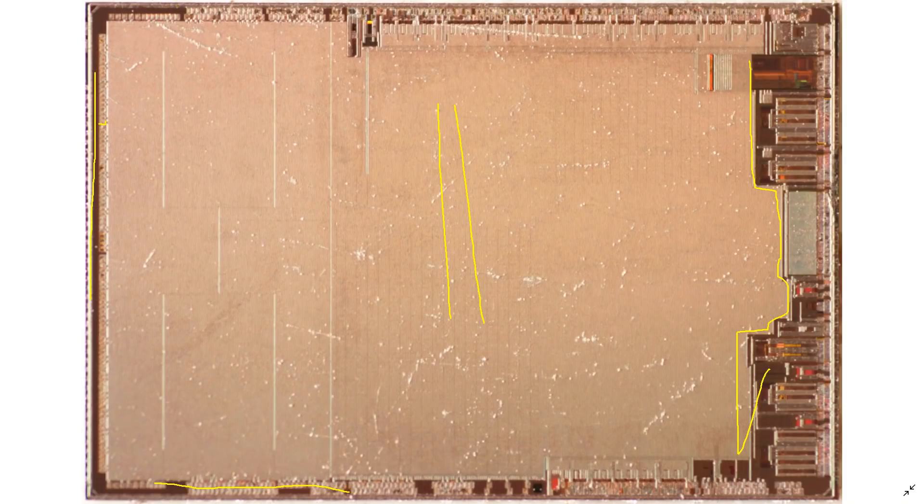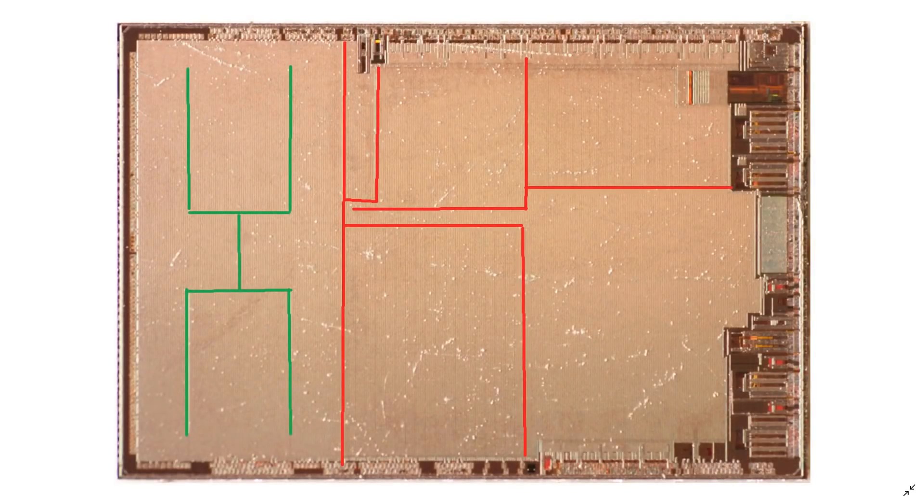The sophistication is basically a function of how much area it occupies. If you look really closely, you can probably see there are some breaks in this pattern - some horizontal and vertical lines. If I just highlight those, what we have here is another hint. We're looking at a system on chip, which is a combination of many bits of intellectual property put together, because the metalization pattern has changed, suggesting these areas have either power gating or special considerations. Next we'll take this metal off and see what we can see below it.